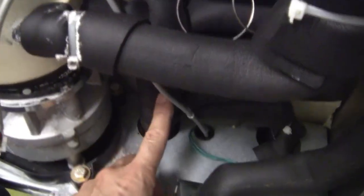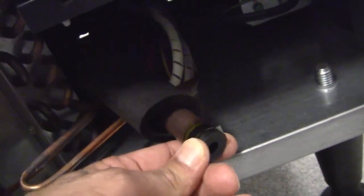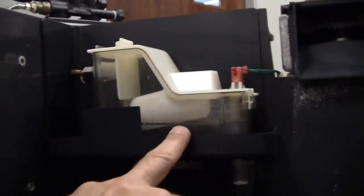This is the evaporator drain line on the front end of the equipment. It comes to this plastic tubing and tees — one cap is on the drain line connected to the evaporator, and the other side comes over to this line. So if you wanted to drain the reservoir, this is how you'd do it — it drains the evaporator and also drains the water level from the reservoir. Both drain together through this single line.